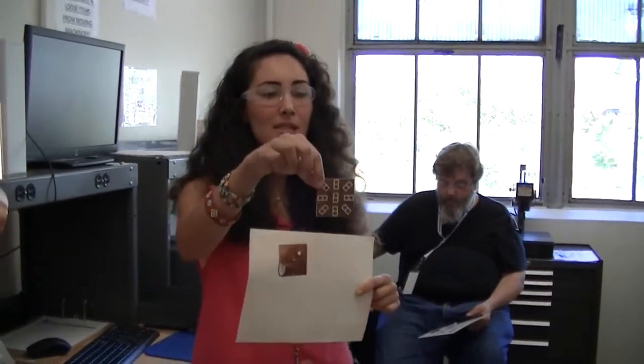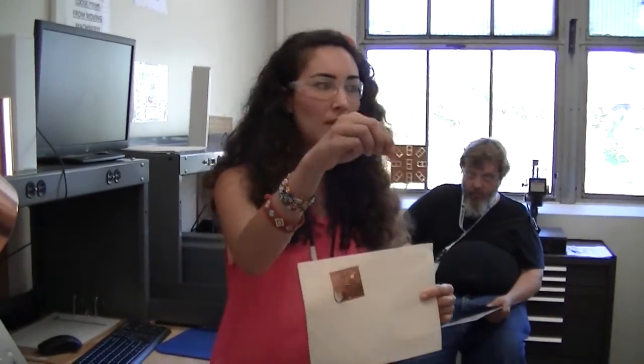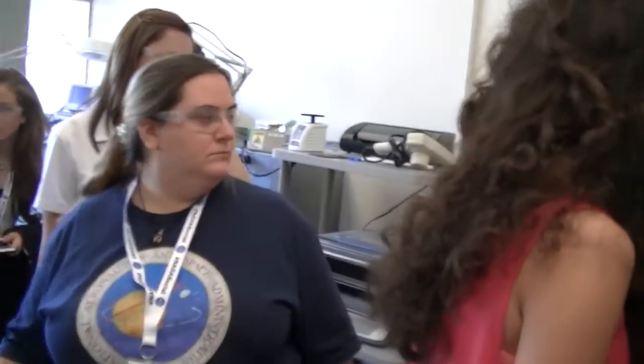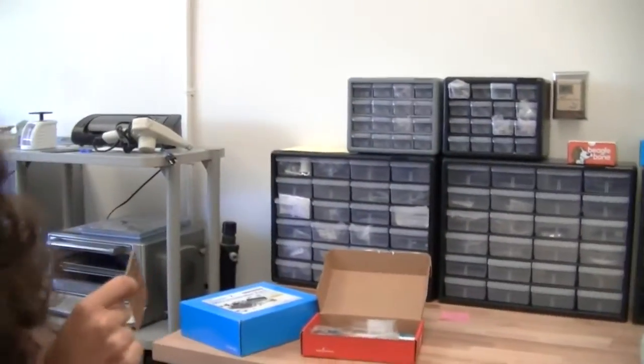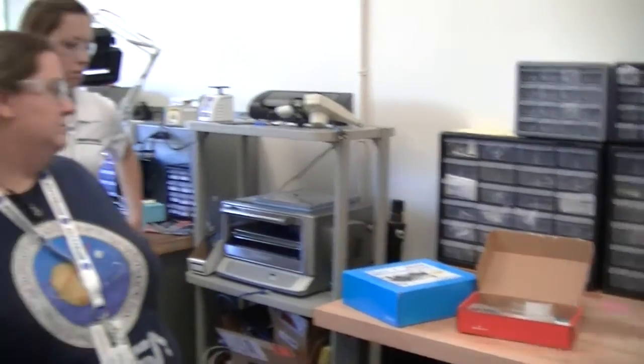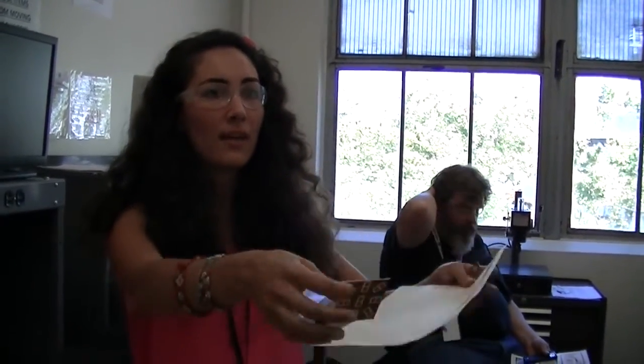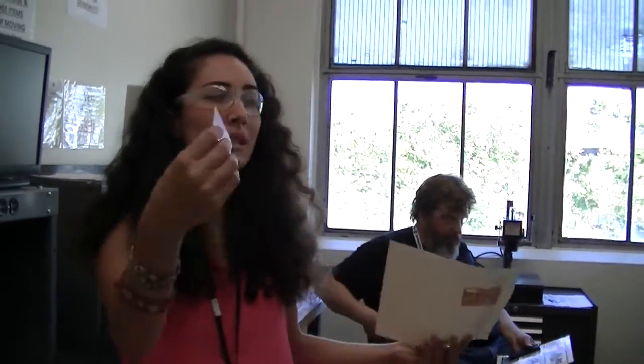We even have the 3D printed panel in the other room that you saw. This fits into that. It has an LED on each pad. This was connected to an Arduino. So we have a bunch of Arduinos here. We connected that to an Arduino, which is a do-it-yourself, quick PCB kit for us non-EEs. And then we connected that to an accelerometer and put that inside of a CubeSat. So depending on how you rotated that, the LED in that direction would light up. We did that in 2 days.